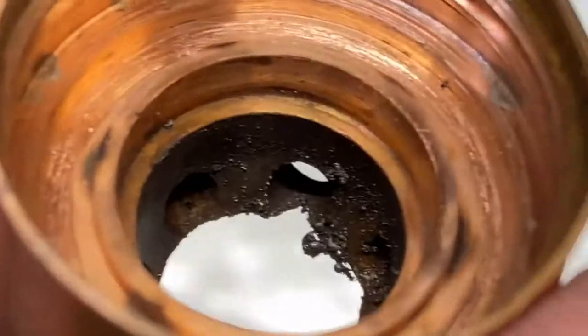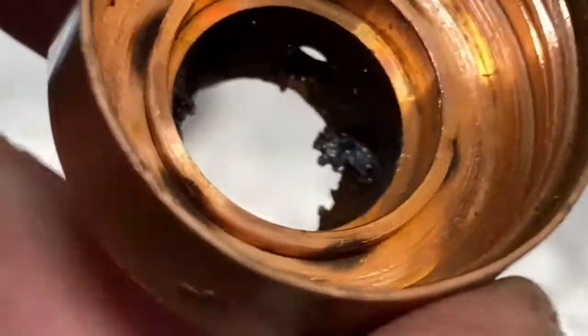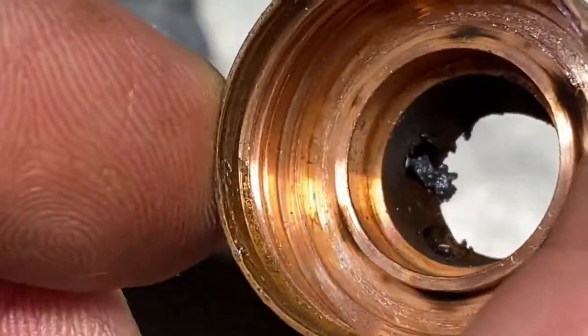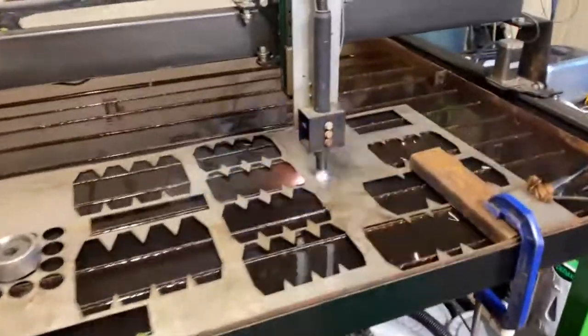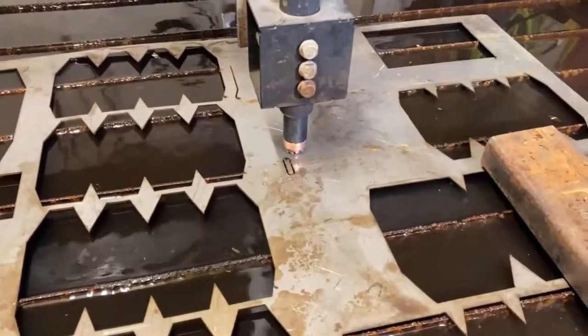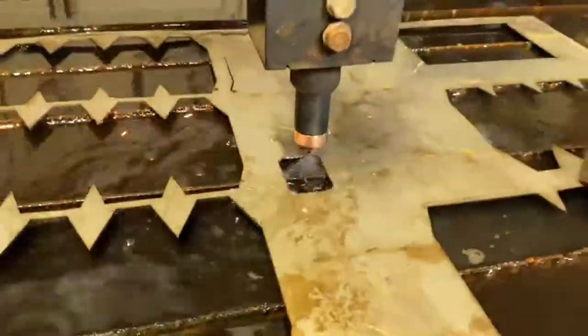Total complete difference. And I probably didn't even coat that as good as I could have because it was already dirty before the application. So a brand new shield and tip from now on will always get coated with nozzle gel. Don't forget to rub some on the plasma torch electrode itself, because a lot of buildup actually likes to stick right on that nozzle because it's kind of hot.